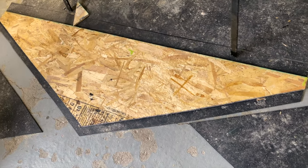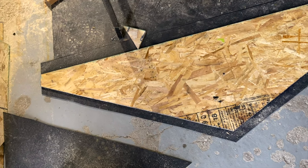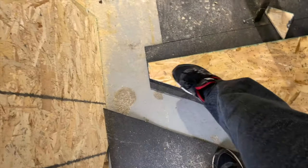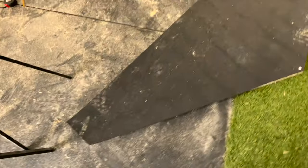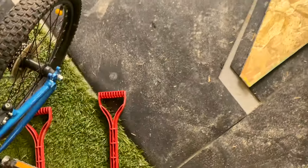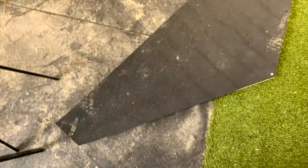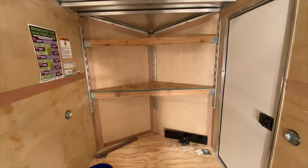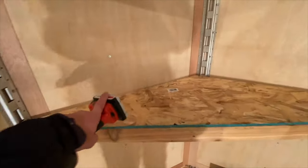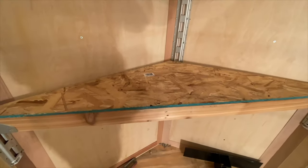Here I cut out a template of what I wanted — I just used a piece of big canvas paper, but you could use cardboard as well. Get the measurements that you need, measure out, and then once you've got the template, I cut out the wood — just some particle board plywood. Now I'm laying down the same template to cut out from this rubber. I'm cutting out a rubber top for it all, and this part I've left longer to actually fold down over the exposed wood. There you have what is a pretty great workbench. I can get a toolkit right here, secure that in, and start working towards doing the top one as well. I'm just drilling this down now with wood screws to keep it fastened.